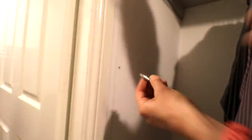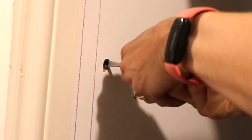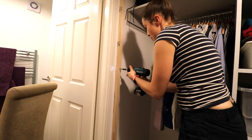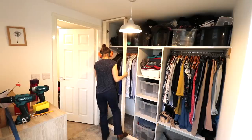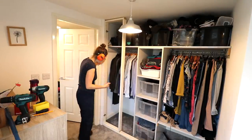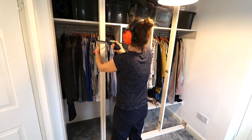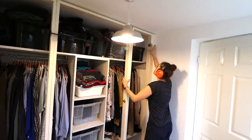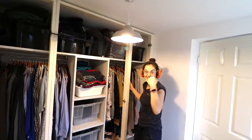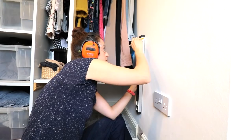Make a larger hole with a six millimetre drill bit — we're going for metal ones, and I've had to buy them especially. Twist and press in a metal plasterboard fixing using a flathead screwdriver, then temporarily put that in and use my combi drill on a low torque setting. Now the moment of truth — do a dry fit to see if everything slots in okay. I'm so glad I used coins to space it out; I think that would have been tight. Once I knew all was looking good, it was time to make sure the rest was level, which allowed me to start planning the final baton on the opposite side.